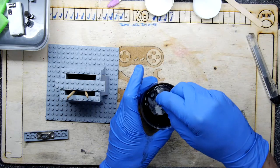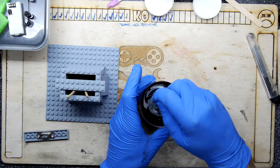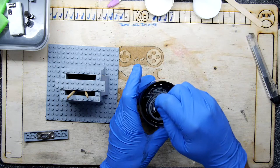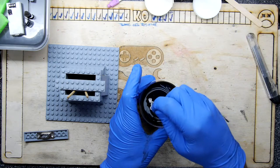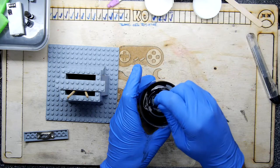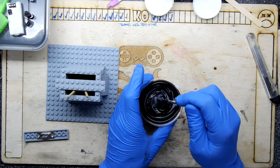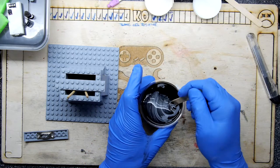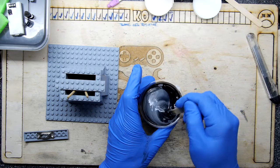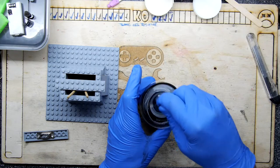But there are probably more than two ways, there's three ways to get rid of air as far as I know. The first way is to do the very narrow pour. And that's a pretty good technique. You should probably just do that anyway when you can. The second way is to use a vacuum chamber. So I think when you prepare your mix like this, you can pop this into a vacuum chamber, and that will cause the bubbles to rise to the surface and pop. But then, of course, you do require a vacuum.